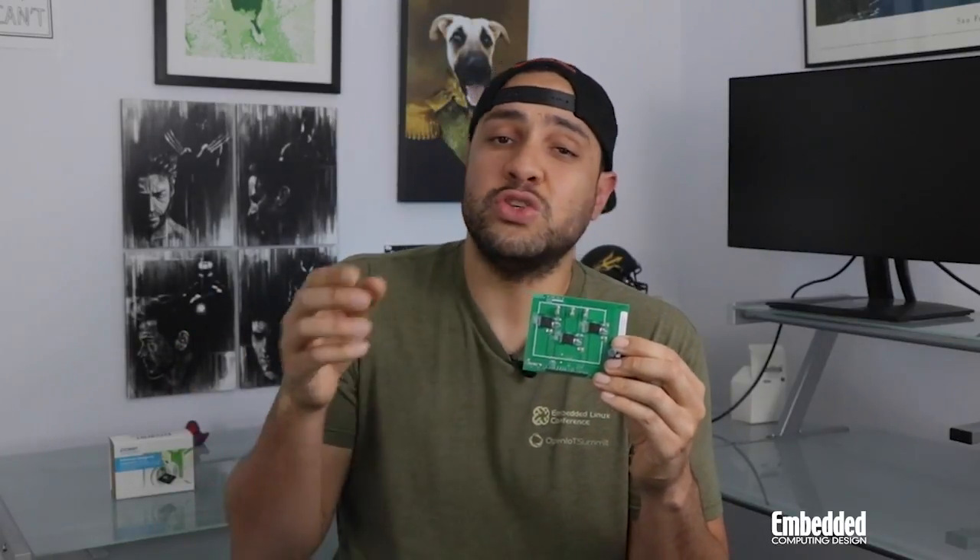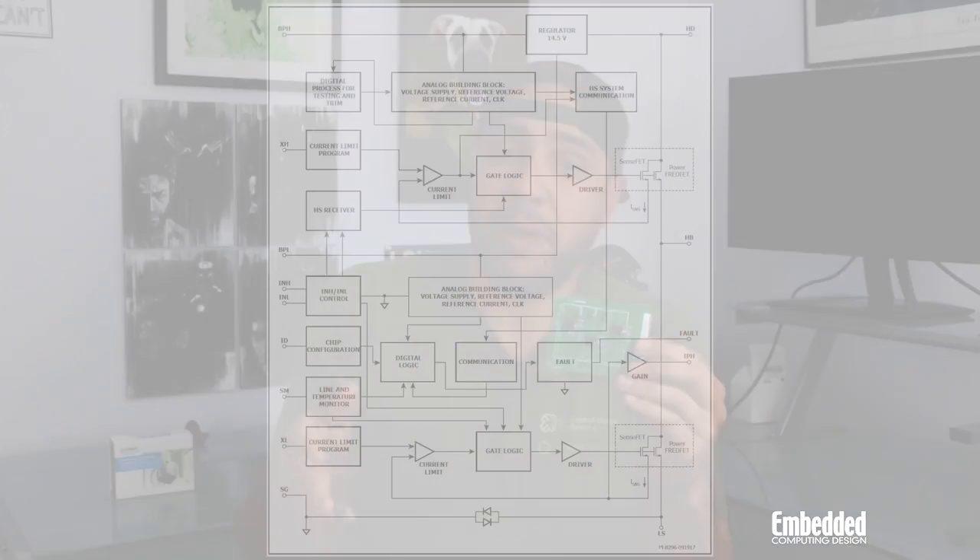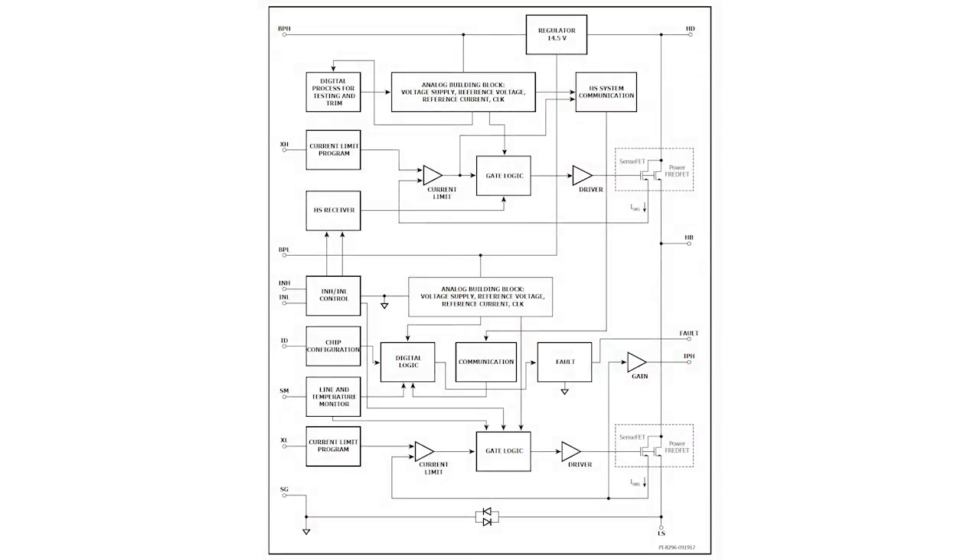These drivers are very tightly integrated with self-biasing high-side and low-side circuits, so in addition to not needing an external heatsink, they also allow you to do away with auxiliary power supplies, though you can use an external bias if you need to, and there's an aux supply on the RDK 852.